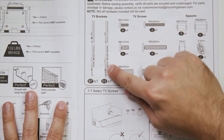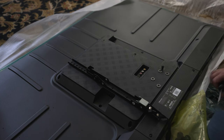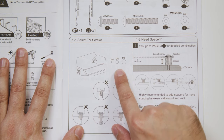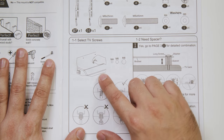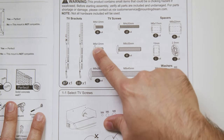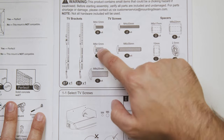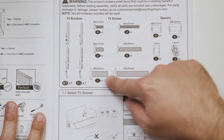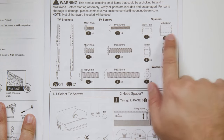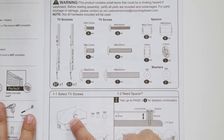The very first thing I need to do is put these TV brackets on the back of the TV — we're not doing anything with the wall yet. I've laid my TV out on a soft rug and I need to make sure I choose the right screw. This completely depends on what kind of TV you have, but the mount comes with a bunch of different screw sizes. The one that worked for me was the M6 12 millimeter. They also have things called spacers — if you need your bracket a little bit further from the wall, they recommend you use these spacers and then put the screw through the spacer and into the TV through the bracket.